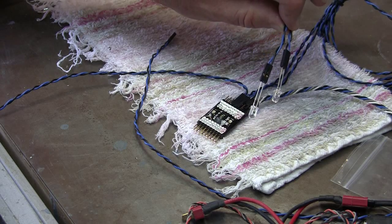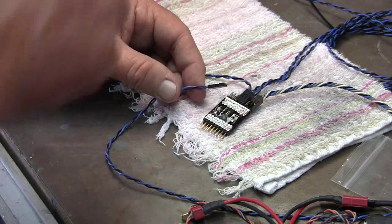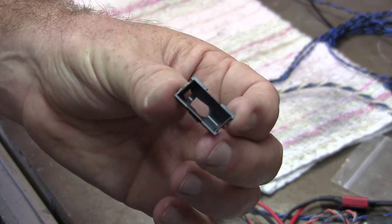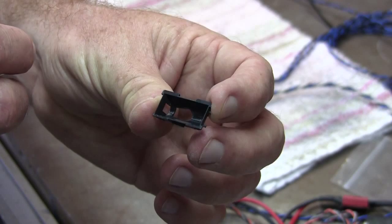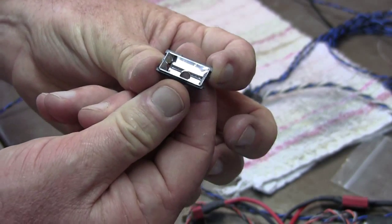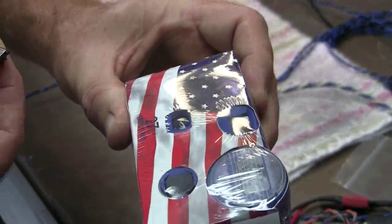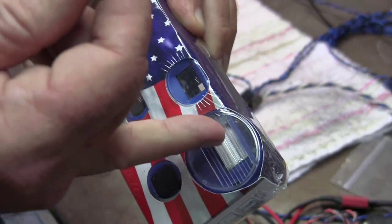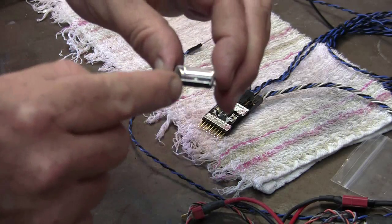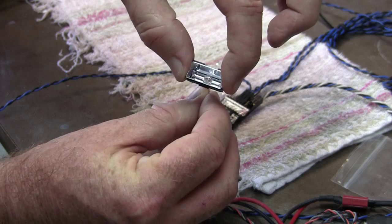I've got hooked up here one red and one green LED, and this one is the landing light. This is the landing light holding fixture — I opened it up in the middle for the LED to mount in there. This is the little reflective piece — it's a flash bulb fixture out of one of these $2 disposable cameras. So this flash reflector is where this came from. These two things will get gooped together and then this LED fits in there like that.